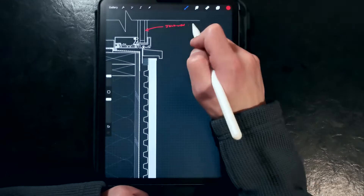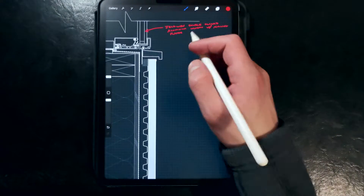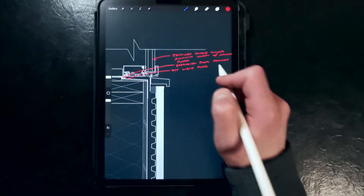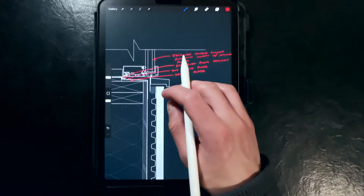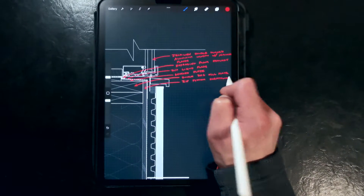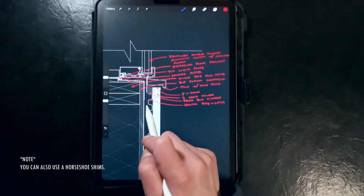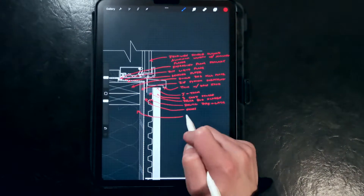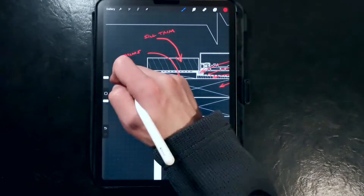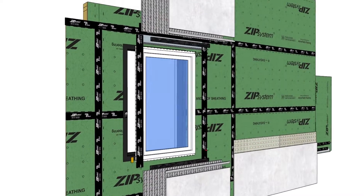You might be asking: what do we do about window and door openings? These are really critical areas that you need to get right. At the sill, we need to make sure that any water that gets into the jamb is able to escape — it's not so much about preventing water from getting in, but making sure it can get out. In this detail, we have a sloped sill and a back dam to prevent water from entering the interior. Then we liquid flash the entire window opening a couple inches past the edges to get a continuous water and air barrier. Install eighth-inch to quarter-inch shims at the base of the window to provide a small drainage gap so water can drain away from the sill and down the drainage mat. We don't want to tape or caulk this spot, otherwise water will get trapped inside. This also provides a good spot to attach the sloped sill trim to divert water away from the window and protect the nailing flange. Then install Delta Dry and Lath below, along with the bug screen and the three-coat stucco layer.